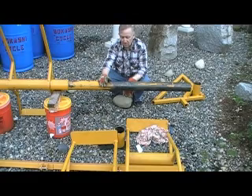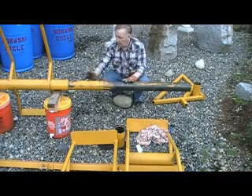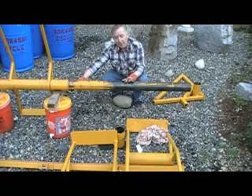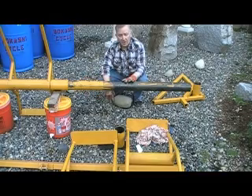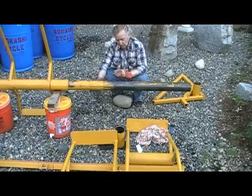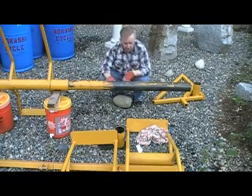So let's get started with the assembly. I've already added the grease to the inside of the shaft for each of the units that will slip on this axle, and I have two 2x4s propped up on top of a 5-gallon bucket, which gives us about the right height to make it easy to do the rest of the assembly. We'll go ahead and assemble this unit now, and then in our next video we'll show how to use it when we're processing fermented waste material.